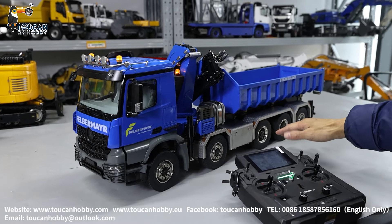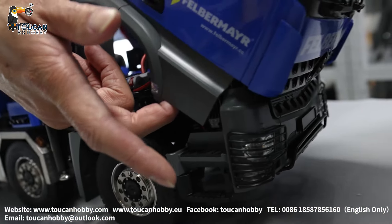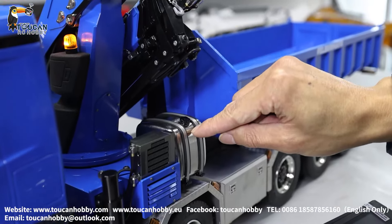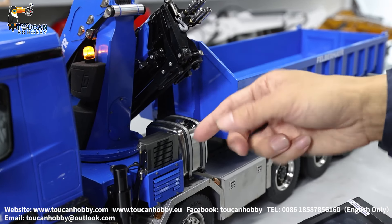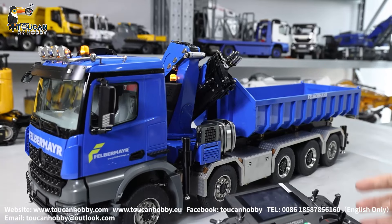After receiving the radio, it comes from factory with Paladin light. Radio first power on, then directly lift up the cabin. We connect a 2S XT60 battery, then lock it back. Lifting downside has a bar — that's the bar for lifting, and the cabin can lock back. Directly push down to lock. Here, the oil tank — open, fill up hydraulic oil, remaining around half oil tank, about 70ml minimum. This cap, do not tighten — only screw in for air vent. Because in the system at the beginning you have air; oil goes out, pushing out the air. Let the air vent.